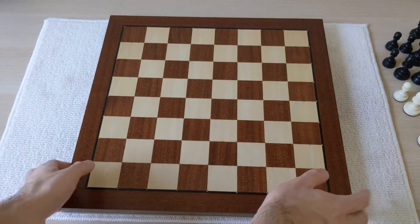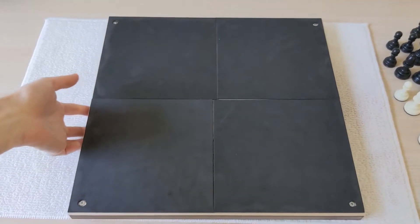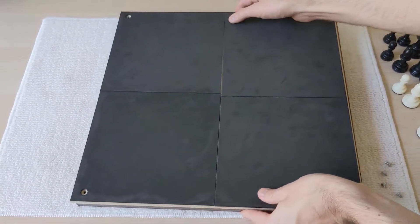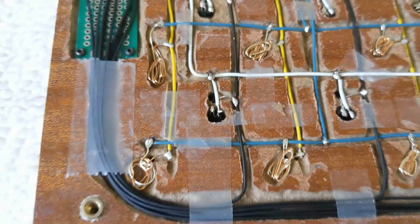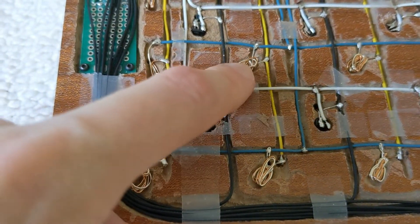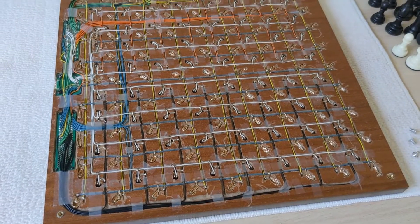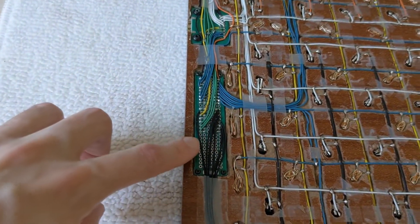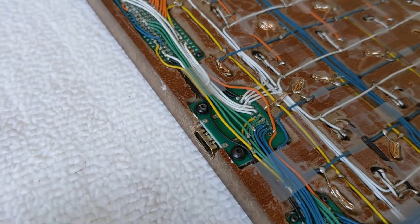The board itself is just a board that I bought on Amazon that I modified to add these LEDs here in between the squares. And if I flip it over, you can see these four screws on the corners. If I remove them, you can see what's happening under the hood. All the electronics here are really just the LEDs and the magnetic sensors. If I zoom in on a square, you can see the four LEDs at the corners, and at the center is a magnetic sensor with a transistor. Everything is wired in a grid and I'm using some multiplexing logic to address individual LEDs and to read the magnetic sensors. These boards here are really just simple logic gates and everything connects through this HDMI connector to my little computer with the display.